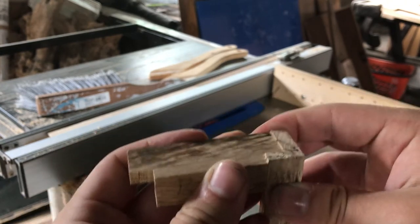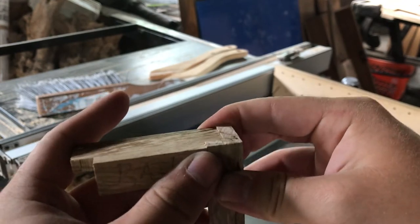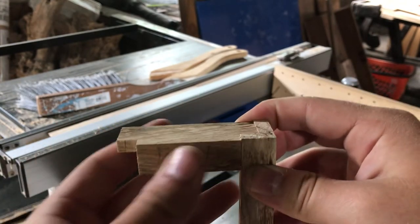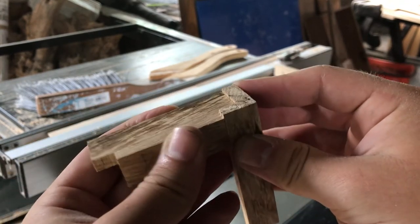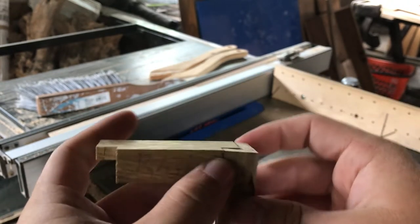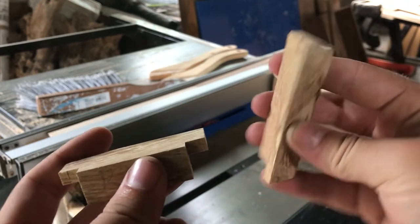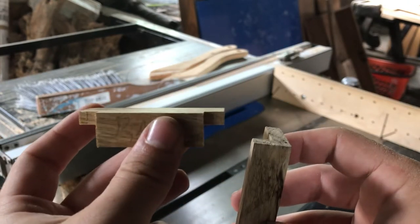I say this because I'm doing a whole batch of these. I'm only filming the big one, but I'm doing a whole batch of these, and the width is not always the longer dimension or the shorter dimension, so make sure you know on each thing that you're doing, if you're doing several of these, which one's which. The good news is, the styles, the tall pieces, vertical pieces, you don't have to touch at all. Once they're cut, and you're good. So the only things you're worried about right now are the rails.